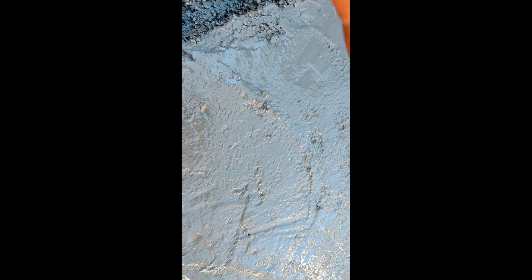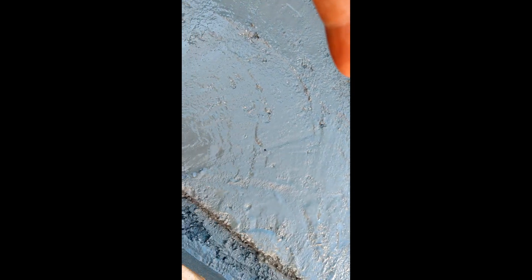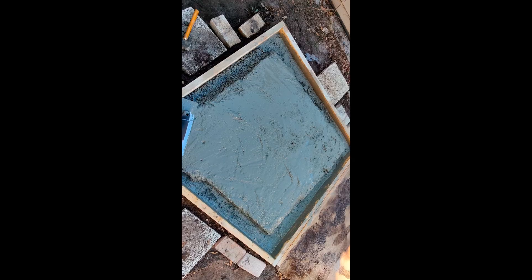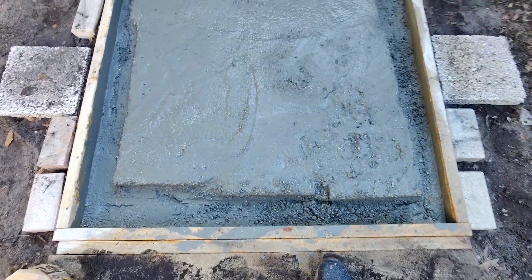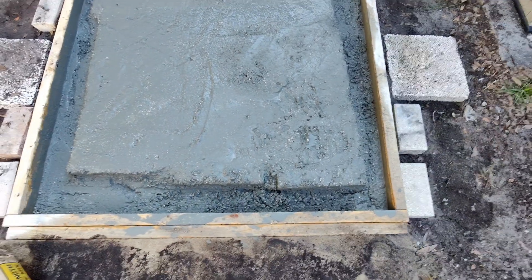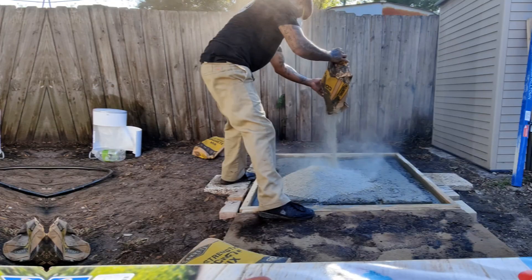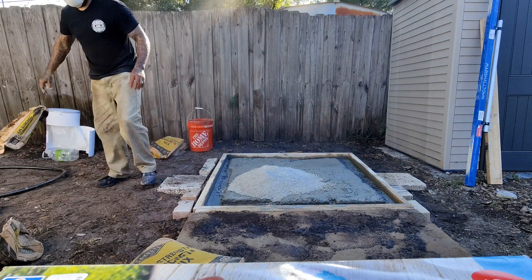When it comes to this wet pour, it's harder. I tried it — didn't do it completely — but I can imagine if I went full wet pour. Right here I'm trying to use a mag float and the finish on a wet pour is a huge process. I ended up going back to the dry pour to save the day. Depending on how big the slab is, you could do it alone if it's small, but bigger jobs need help — it's back-breaking.